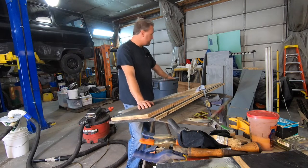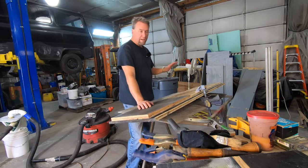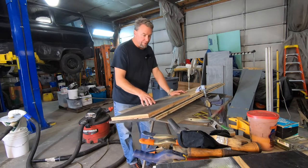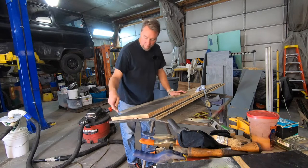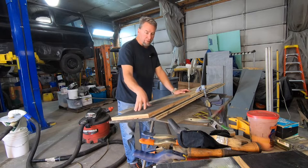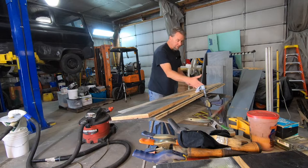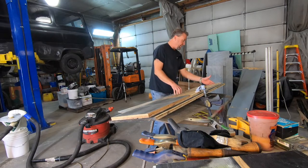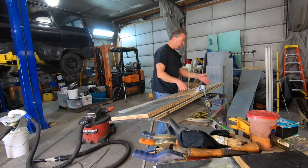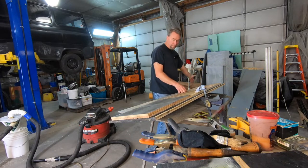I took the extra time to tape and label the hardwood floors. There's tape all over the hardwood floors, which is good. It's holding all the interlocking pieces together. And then that will be screwed in on the ends. The hardwood floor will be screwed down to this. Then we'll router in the hatch hardware, and I'll screw like I did the last one, probably up to about 3/4 of the way. And then the back half will mark the edge of it once I know all the boards are tight together. And we'll cut that square, and that gives us the tail end of this hatch and the beginning of the next hatch.